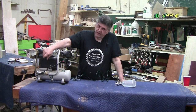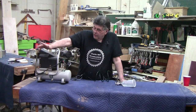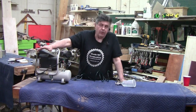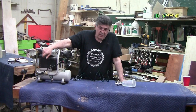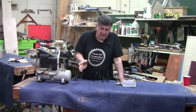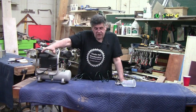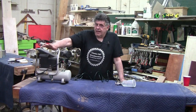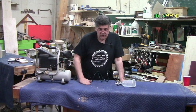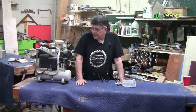Would this run an air sander? Not very long. About the time you start and get going, you're pulling on an air sander double what we're pulling on this spray gun, and every time you let off the trigger it's going to pick up, but it's just not going to maintain it. If you're using an air sander and you start slowing down, the grit is going at a different rate and it can cause fish hooks and scratches. So that's something to think about.